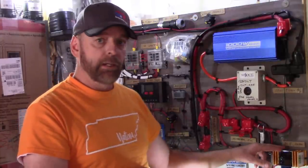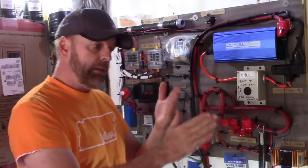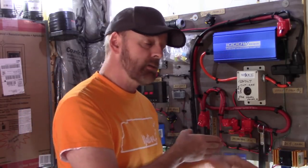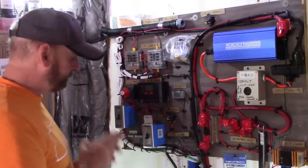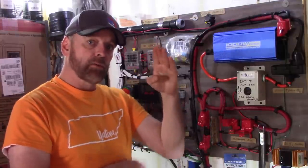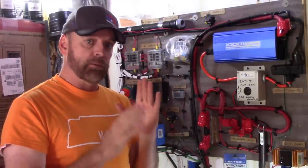I'm going with Rulking batteries, keeping it as inexpensive as possible. This other device is called a BLS. Some reviews online call it snake oil, but I've installed it on every one of my systems. The BLS hits the batteries with a square wave to desulfate them, making them last a lot longer. I know it works — I had a battery bank that I gave time to charge while using the BLS and it completely recovered. For wire, I'm going with 4/0. Don't skimp on wire.